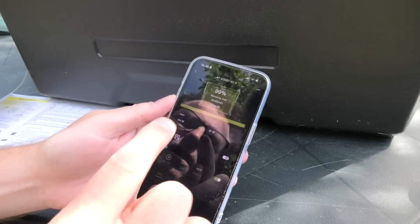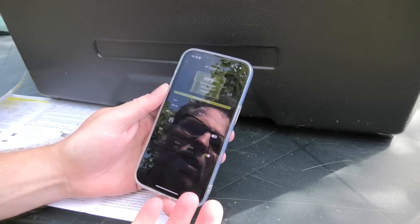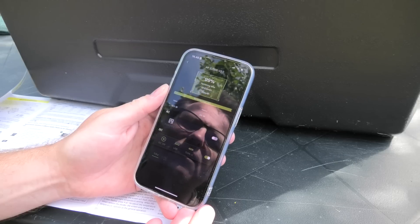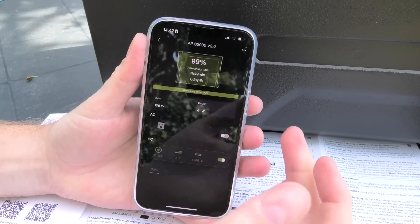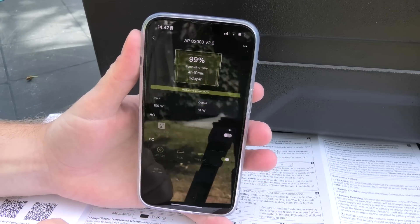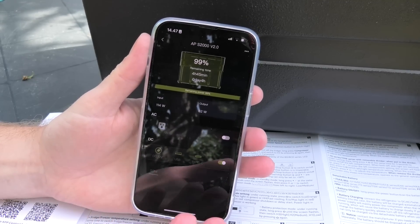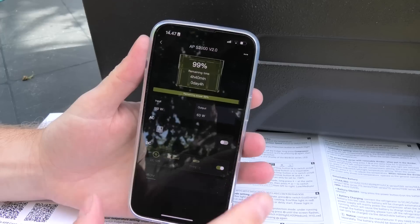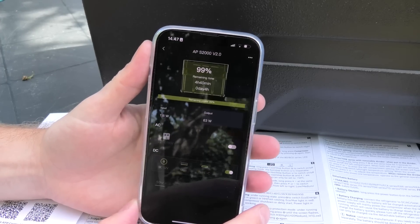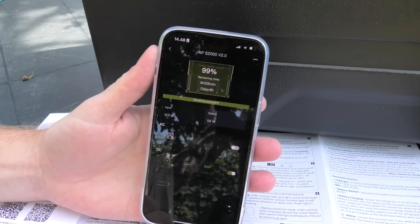We are getting 100 watts in, and I have juiced up the power station while using the refrigerator — so when the sun is shining, you can still do that. It is 200 watts of solar panels; we do not get full 200 watts here in Denmark. If you had a smaller power station I think that could do it too — the smallest I have can do 600 watts, and this is only drawing about 60 watts, so one-tenth of that. The power capacity of a power bank like that would be around 500-600 watt-hours, so it could run this for somewhere between 8 and 10 hours.